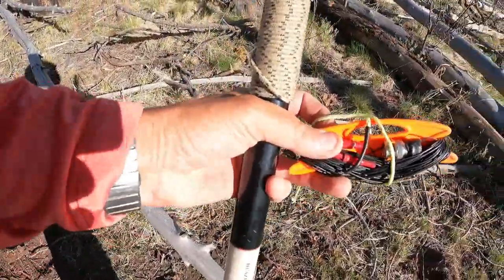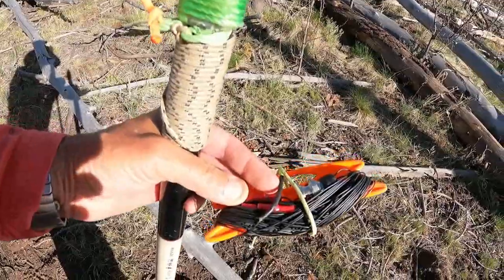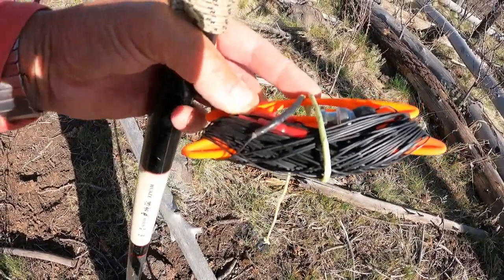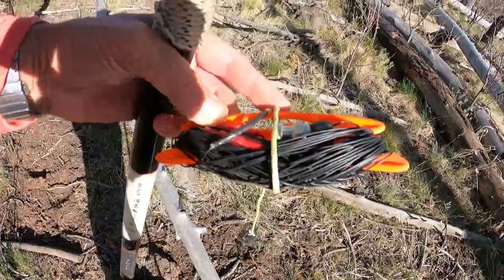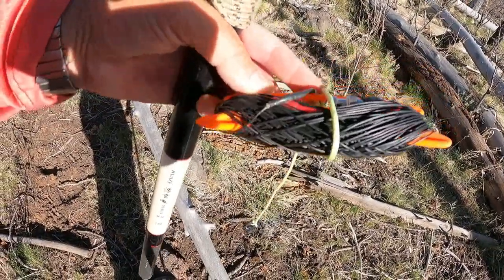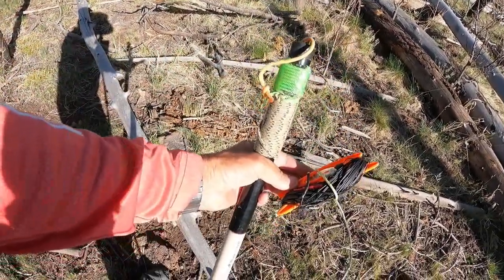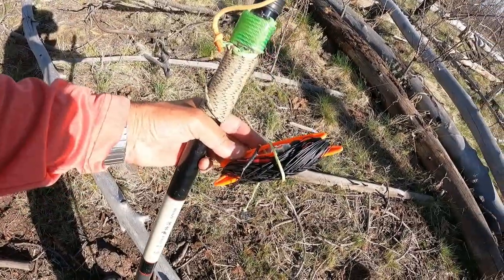People like to know what I'm using for an antenna. I'm using this K6ARK antenna — it's a random wire. Goes right into the UNUN, which is right on the BNC, and it goes right into the KX2. This is my go-to antenna. I'm kind of lazy — I don't like getting up and changing links on a link dipole, although I will. But it's fantastic for band-changing because you can just hit the tuner, change bands, hit the tuner, and you're up and running in just seconds. I've worked France, Spain, Belgium, Slovenia — this thing just works. It's not going to be the most efficient, but I really like it. I'm going to use this small fishing pole — it's about three feet collapsed. We're going to stick it up as a sloper, throw the counterpoise out, and get to work. It's a super easy setup.